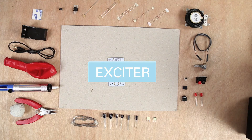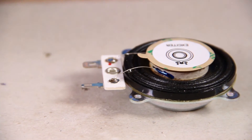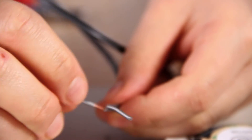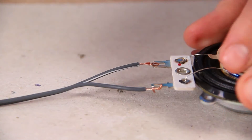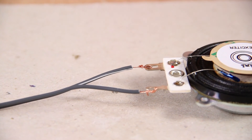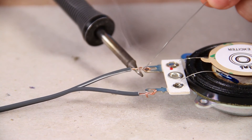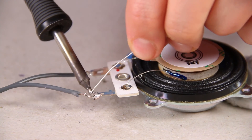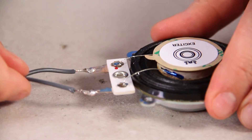The exciter is a type of speaker that attaches onto surfaces and turns them into resonating surfaces. The next stage is soldering your exciter to the copper wires. A neat trick here is when you separate the two wires, use the plastic sheath to twist the metal so it makes it easier to solder later on. Your wires should be securely on the exciter before you start soldering. Hold the soldering iron underneath and add solder from the top — it should join the two nicely. It's not a very precise process, just enough to make a nice solid contact.